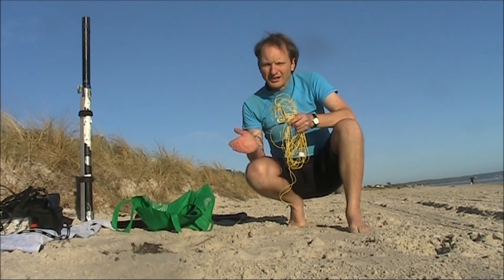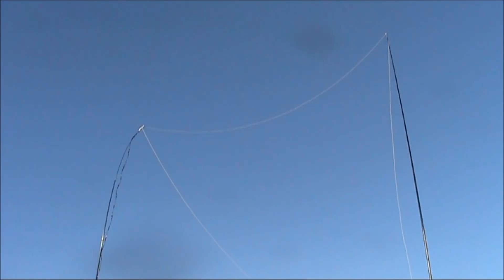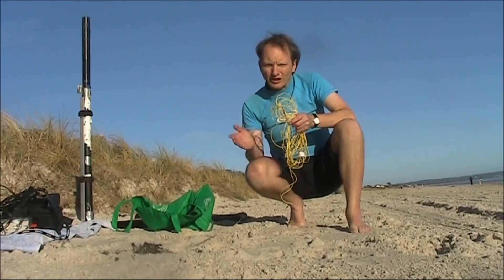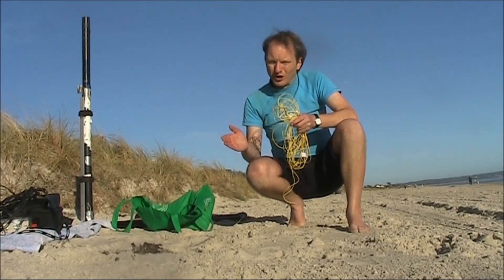Today I'm trying an antenna that I'll call the 666 Delta Loop. That's because it's 6 metres a side — just under a full wavelength on 20 metres, but near enough, particularly as I'll be using open wire feedline.